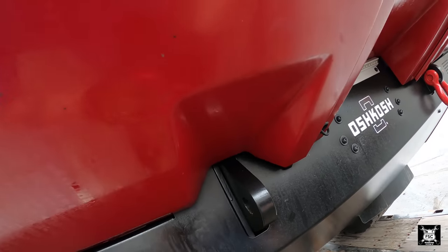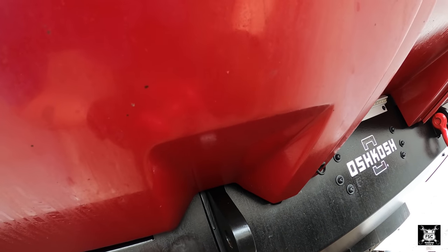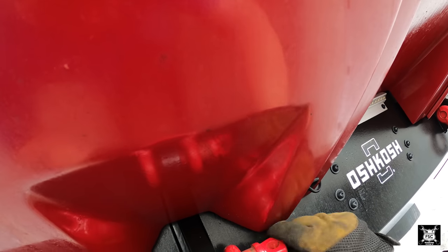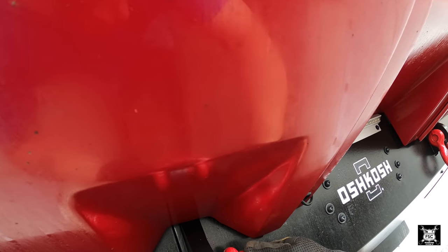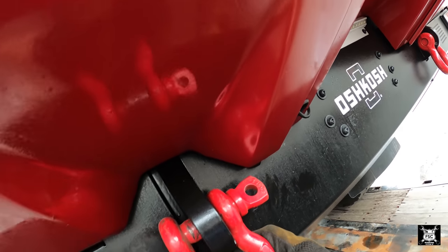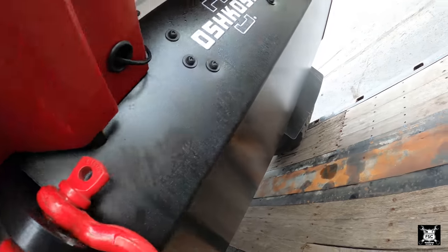One thing I did forget to mention is when you tighten these, I know I mentioned it on the video with the excavator, same thing. The twisting action isn't what makes this tight. It's just the fact it's there. So tighten it till it's tight and back it off like a quarter to a half turn. Once the chain's pulling on that, it won't move a bit.